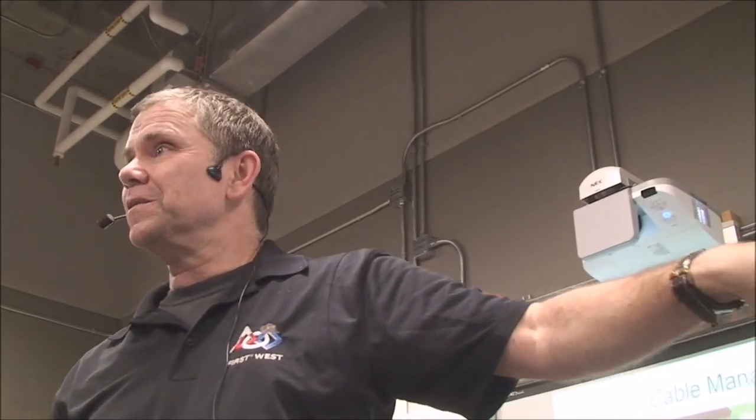I just did it because it looks good, and I had some plexiglass from an old equipment chassis that was kicking around. I cut it with a jigsaw along here. I had to pre-drill all the holes, and for a lot of the connections in here, the screw terminals, I pre-drill the holes and put the screws into them. If I let the screws thread, I'd probably end up cracking the plexiglass.